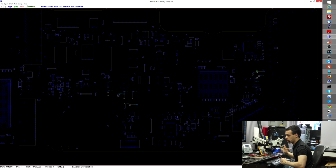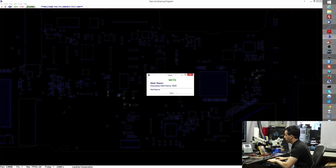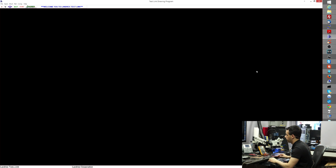Now, I'm also interested in what state I'm in. So if I have PP5ES3, the machine is clearly making it to an S3 state. Now, I may be interested to see if it's in an S0 state. I mean, because the newer Airs, all these Core i5 platforms, they're supposed to turn on as soon as you plug the charger in. It's not like it waits for you to hit the power button to turn it on. So let's see what I get for PP5ES0.